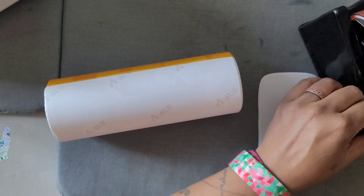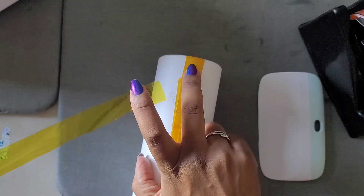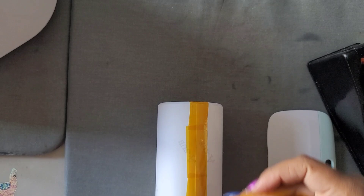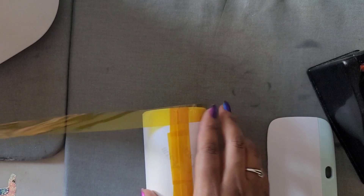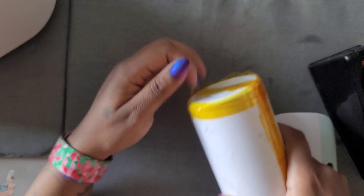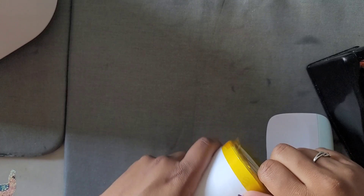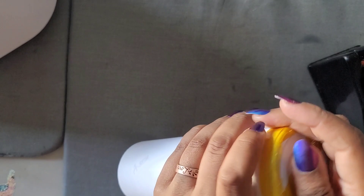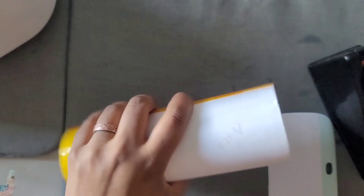Since it's overlapping just a little bit, I'm going to put my tape on and have it going tight toward the part where the seam is — the seam is pointing to the left so I go left. I smooth it down and pull as tight as I can around. If it makes little creases, I like to just pull those up to get the creases out. Wrench it like you're trying to get a top off something that won't come off, because you want it on there nice and tight. Then do the exact same thing for the top.